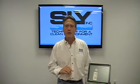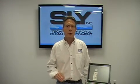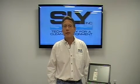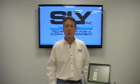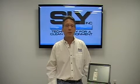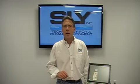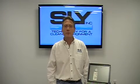Be sure to monitor your dust collector's pressure drop over time. Best practice is to record differential pressure each day. This will allow you the ability to spot issues with your dust collector, such as bad diaphragm pulse valves, solenoid valves, timer, or other issues that may be caused by poor compressed air quality. Frequent monitoring will give you time to order replacement filters and parts before an emergency situation develops.